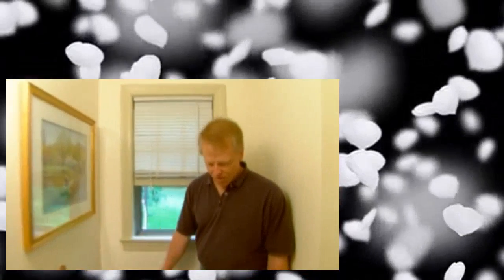All right, so this is all new walls and tile floors in this bathroom? Yeah, everything's new. The walls, the ceilings, the floors. The floor was a job in itself to take out. It was about that much. I don't know, cement, I guess. Oh, they called that a mud job, and that was the best job you could get in the old days. They used to put 1.5 to 2 inches of this dry cement as a base for the tile. Yeah. It was hard to do. It was even harder to get out.